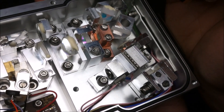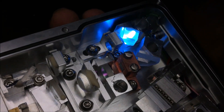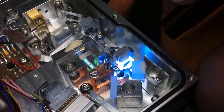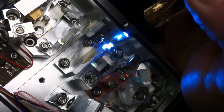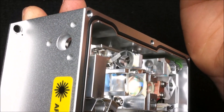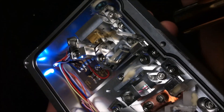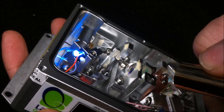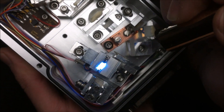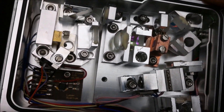That red laser light is allowed to pass through this reflector, hits this little dichroic dielectric mirror, and then exits through a concave expanding lens. It also passes into this convex lens, which is the collimating lens for the red laser light. There's a small glass reflector that shines light up into this area, and on the back you can see there's a photosensor. Underneath the pump diode is a thermoelectric cooler, and there's another thermoelectric cooler that controls the temperature of the lithium triborate crystal. Lots of little things going on inside this laser.